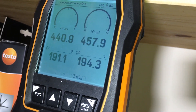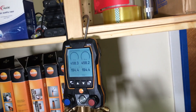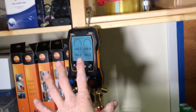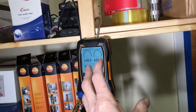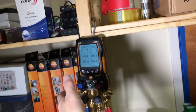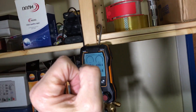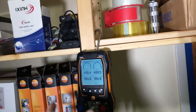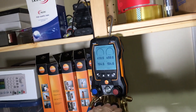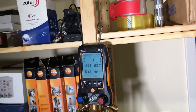Crank it on — that's good enough, I'll let it stabilize. When you're doing a nitrogen pressure decay test, you open it up to your bottle and let it set for 5, 10, or 15 minutes — however long — to let your tools, your hoses, and everything settle out, stretch, and get acclimated to the new pressure. If you instantly pump up to 450 or 650 PSI and right away close it off and use that as your zero point, you'll get false readings from the copper and fittings slightly stretching. Let it acclimate for five or ten minutes and then turn it off.